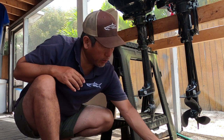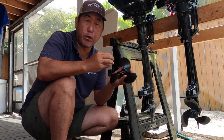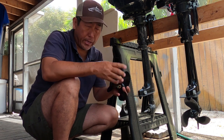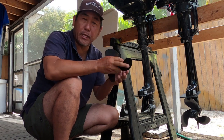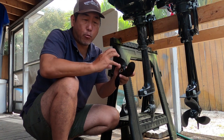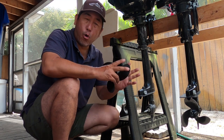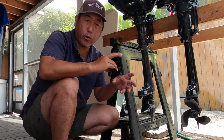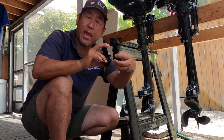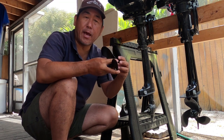My newer model uses what's called a hub - a pressed-in rubber bushing that fits inside there. Normally it works fine. It grips onto the side of the prop and it spins normally. When you impact bottom or structure, that rubber will absorb some of that shock and prevent any damage to the lower end. Or if you do it hard enough or continually over a longer period of time, that rubber hub will actually slip and break free of the outer prop housing and basically free spin at that moment.